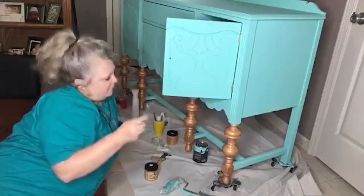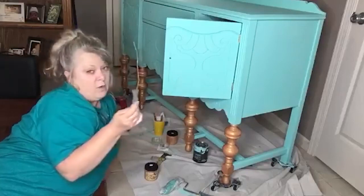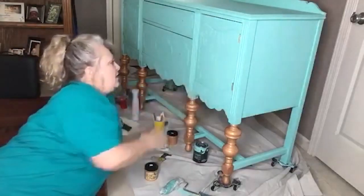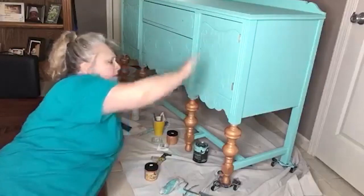And he said, if you're filling something in and the old holes are too big, you go out in your yard and you get a green switch and you break it up and you drop it in the hole, then you put your screw in there. And that'll expand and contract to fill up that hole.